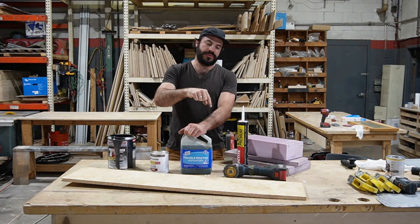We use this over something like Liquid Nails because in my experience, this holds better, but it also cures a lot quicker. If you look at the original Liquid Nails, it has a cure time of like 2 weeks, which is just not gonna fly for us. So what we'll do is we'll pre-cut the piece, we'll glue down the foam and the plywood, and then we'll bag it. So we'll put down a bunch of sandbags on top. And we like to use about 8 sandbags per 4x8 foot sheet that we install.